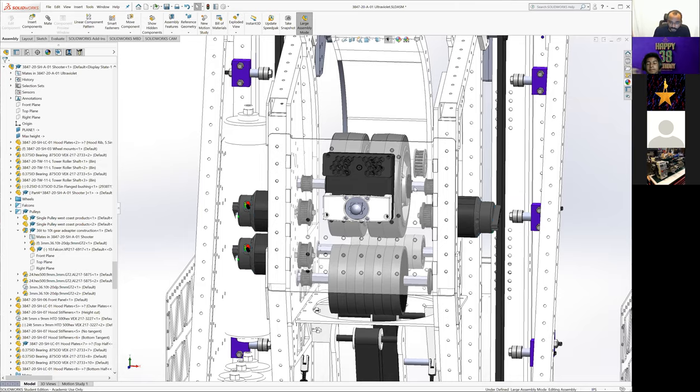So we weren't putting large flywheels anywhere on the robot. The two Colsons up here have enough mass for us, with our two Falcons, to maintain a pretty good RPM range as we're firing through all those balls. We could sit there and graph the RPMs of the shooter wheel as the balls were exiting. And they weren't perfect by any means. There was some tuning we were going to try to do throughout the season. But they were pretty good. It was a relatively small band of RPMs. The wheel was staying pretty consistent throughout the entire shot because it had enough power, and because the wheels gave it enough mass and inertia to not lose that energy as the balls were flying through.